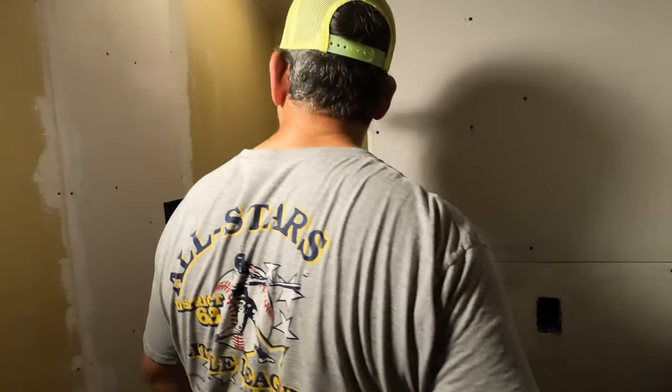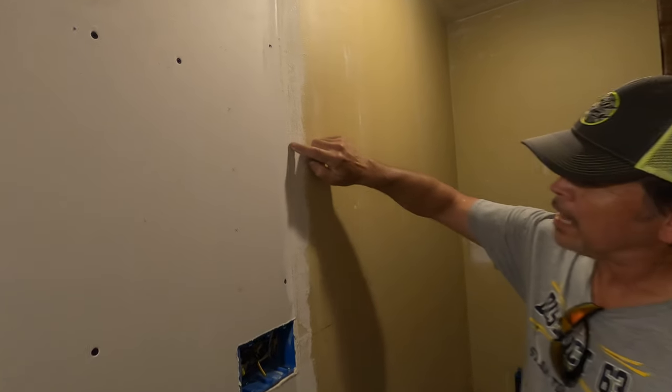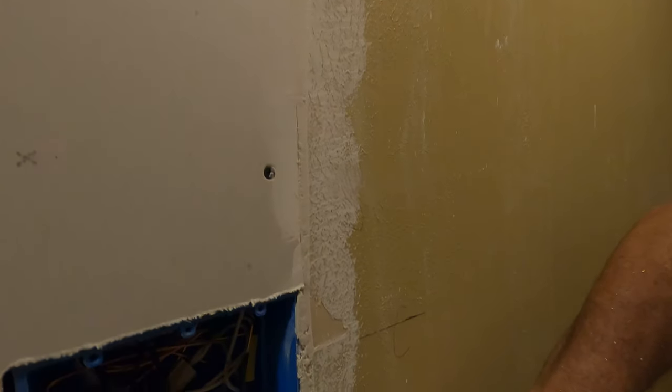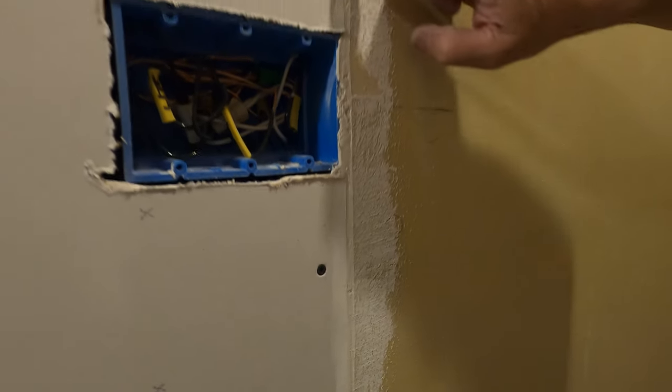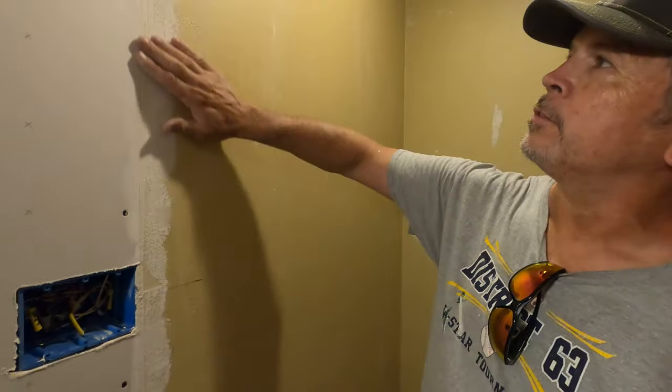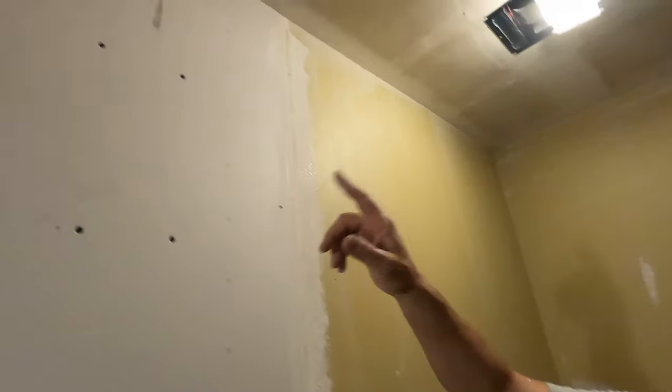So what we do, we just went through and we pre-filled the bigger cracks. And when I mean bigger, I mean, for me, usually anything larger than 3/16. So we had these, the corners. So now everything's really tight, and it's time to start putting our all-purpose on. So let's go outside and mix that up.